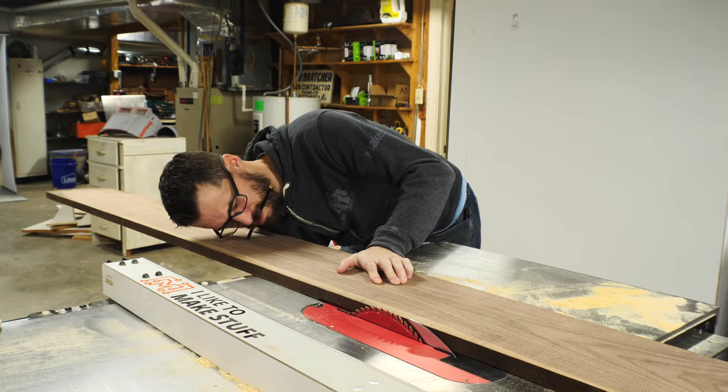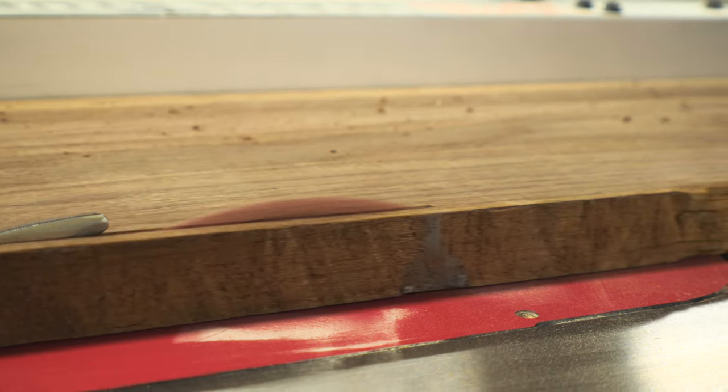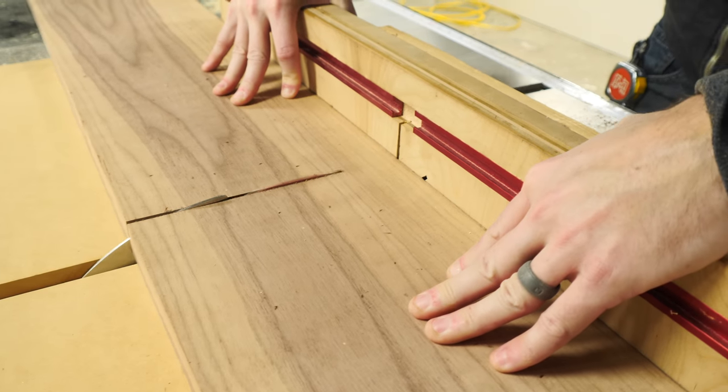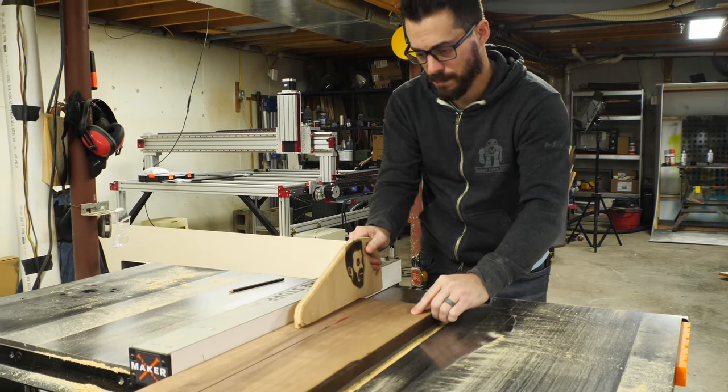Since my tests were finished, I moved on to my actual piece of walnut. It was milled down pretty well, but the first step was to get a nice clean edge. So I ran it through the table saw and trimmed off one outside edge that I could reference against the back fence of my crosscut sled. From there I cut the pieces to length and then ran them through the table saw again to rip them to the right width.